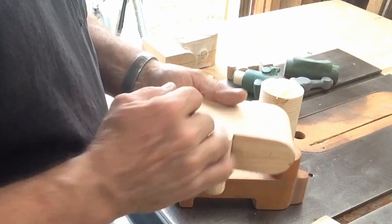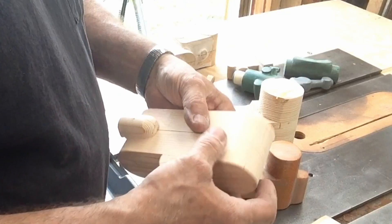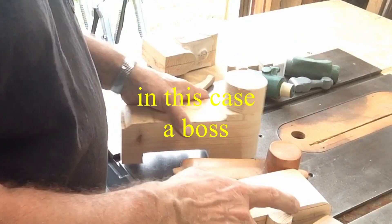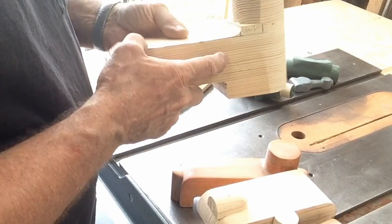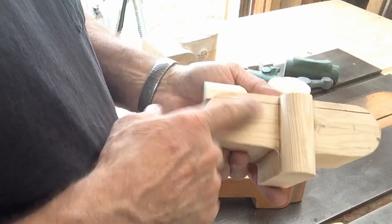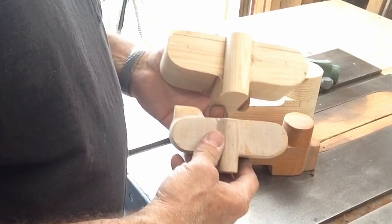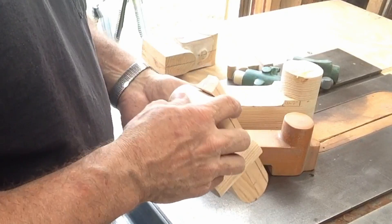This pattern is basically formed and done — we've got to fill the edges and then separate it. I planned these as a split pattern so we can separate them in the middle. All these places where I've added a joint on the split line, I'll go ahead and drill and dowel those, align them through, then separate them and put them back together for final fill and sand. We've still got quite a bit more material to remove and smooth up. A third larger — we'll have a quite substantially larger machine when we're done. It'll take care of all the capabilities I want for a true tool and cutter grinder in my home shop.